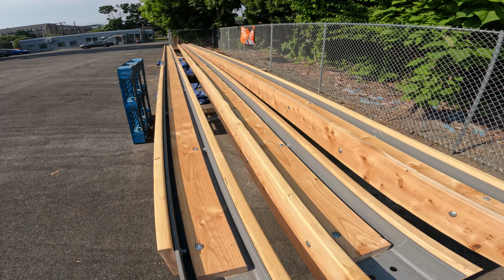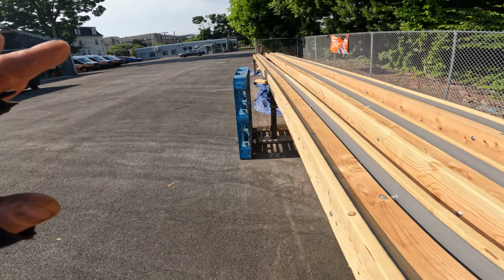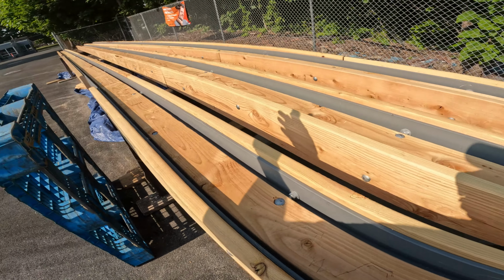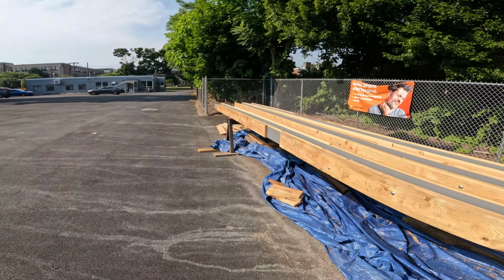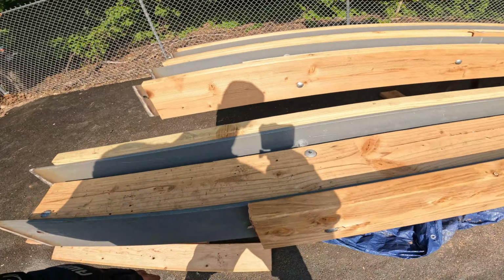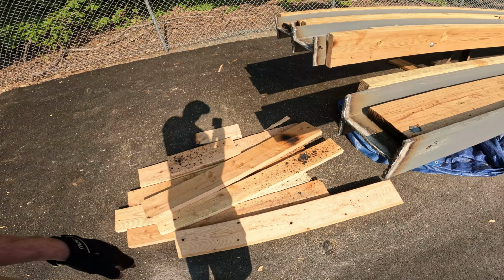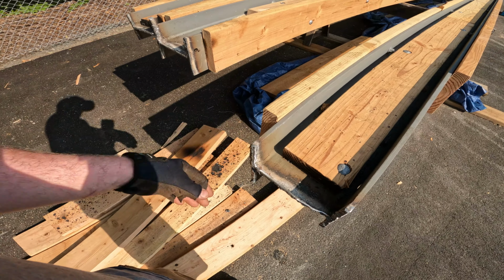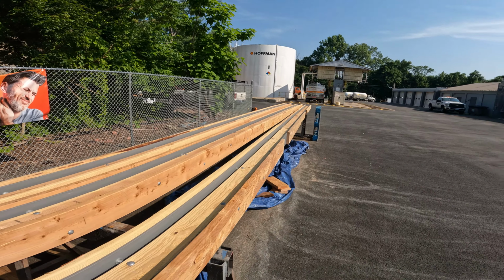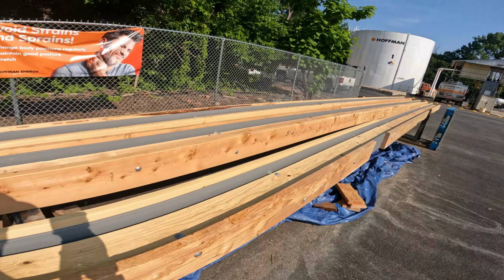This is on top of that fourth post over there, the splice. Once this beam gets tipped up, this is the bottom, this is the inside, and so this side here lands on top of the end of the building. So it gets welded to that first post right here. This was cut with a torch today, and we had to cut these back a little further. That side of this metal beam lands after the third bay, and then it gets the splice plate bolted on.